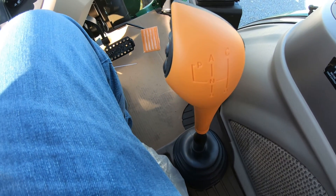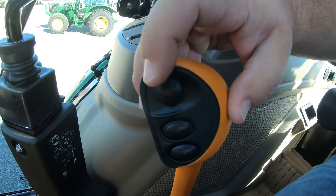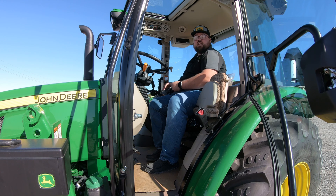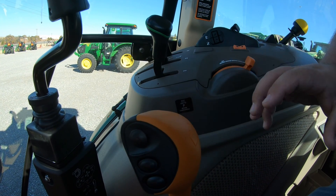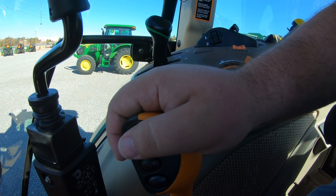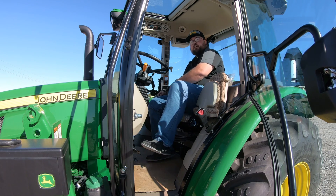This lever is used in the pattern shown here to select our ranges. We have a foot clutch down at the bottom, and we also have a clutch button up here on the top of the shifter — this is our D-clutch button. This is the thing that makes this transmission very nice for reducing fatigue. When we need to change between ranges A, B, C, and D while moving, all we have to do is hit this button instead of having to use our foot on the clutch.